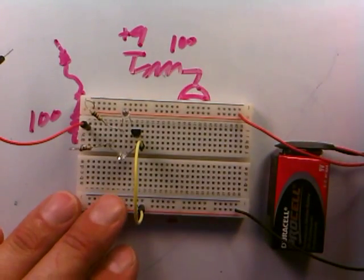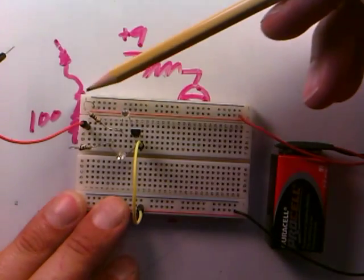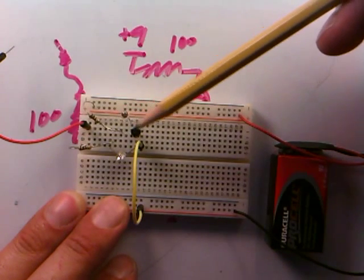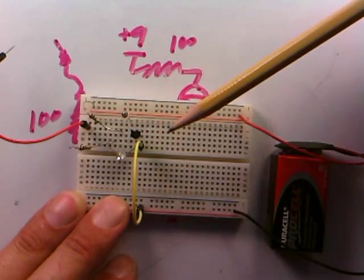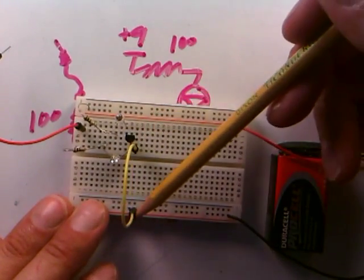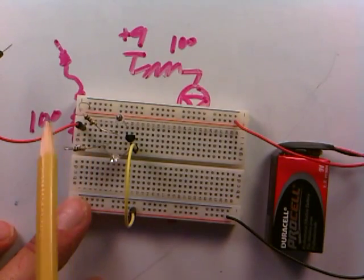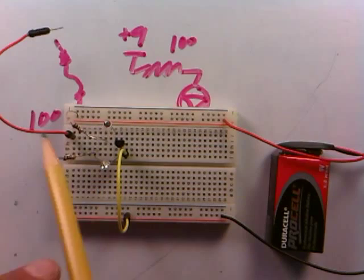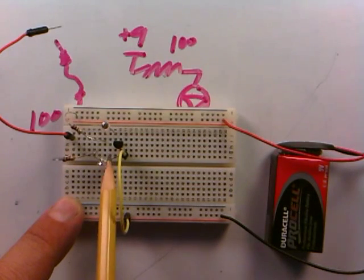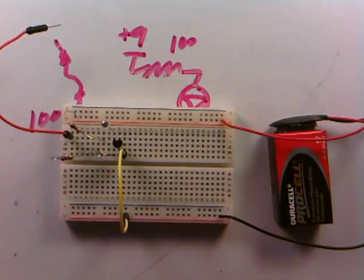Just a quick rehash in case you're just joining us: here's the resistor starting at 9 volts — this top row is all at 9 volts because of the red lead — going through the 100 ohm resistor, through the LED, with the flat side connected to the collector leg of the transistor. The emitter, the rightmost lead, is grounded. On the other leg, if current passes through this unconnected wire, it'll go through the resistor, through the LED, and into the base of the transistor — the flat edge of this second LED connects to the middle lead, which is the base.